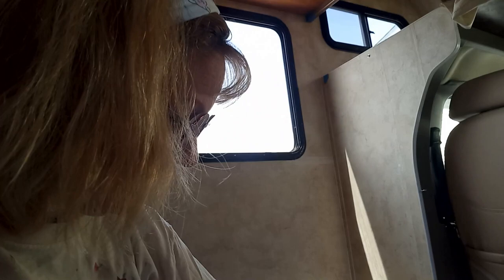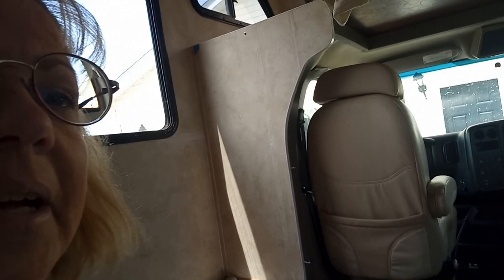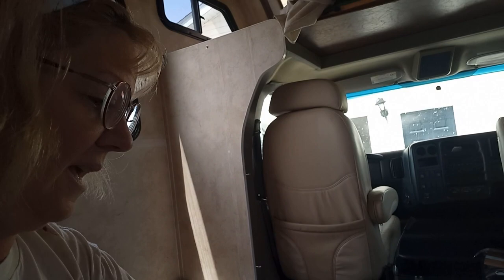This time we're going to use some Zinsser Fast Primer and Sealer. This is just really good to seal and bond, to help your paint stick to the walls. I don't have a lot of big walls today, so I'm just going to use my handy pail and a little tiny roller, a cut-in paintbrush, and then I've got just a wallpaper smoothing tool. Sometimes if you need to just put it down in some areas so that it'll protect an area, that's a good thing just to have.